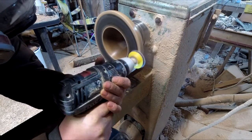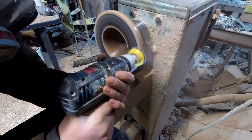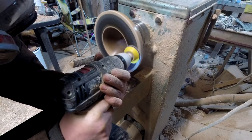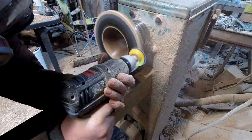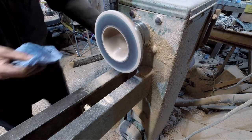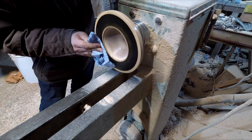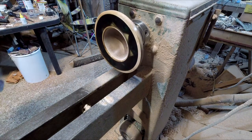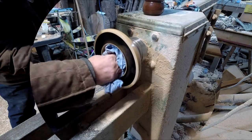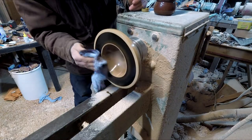This is 48 hours in, no more than that. This is 3 days later after a second pour of resin, up to the level of the top rim. I didn't want to take a chisel to this — I just wanted to take a 180 grit pad and sand everything flat, rather than putting chisel marks into the resin that I'd then have to get out. I sanded this all the way up to 2000 grit, then with Yorkshire grit microfine paste, and then a liberal coat of shine juice.